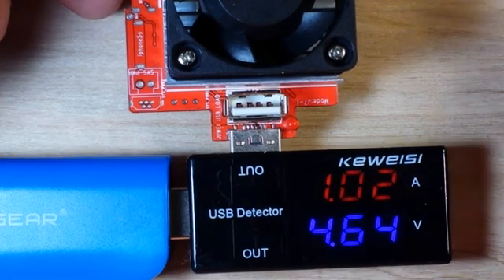Great Power, huh? Let's see if we can get the board out. So what we've got here is an inductor and this chip here which is an MP3401A — that's just a P-channel MOSFET. Other than that, we've got a capacitor, capacitor, and a couple diodes. That's it on there. So if we take a closer look at the battery, we can see that there is protection in the battery itself.